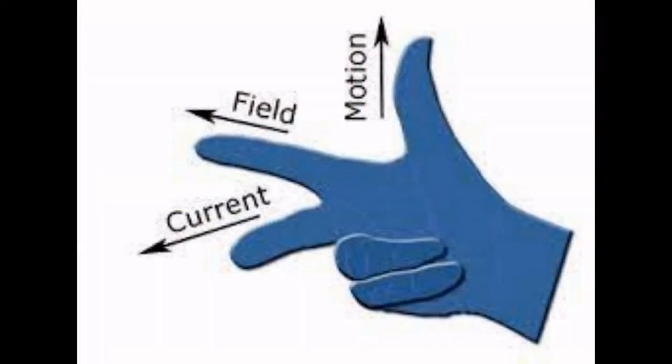This is exactly where Fleming's right hand rule comes from. It's a description of what would happen with those vectors if you set them at 90 degrees to each other. We've got a magnetic field going that way, we move the wire that way — the current's going to go that way. And that's all it does. It's describing how those vectors would interact at 90 degrees to each other.